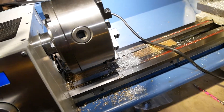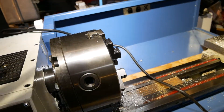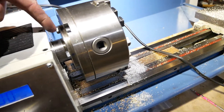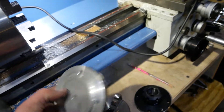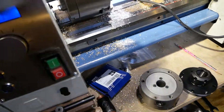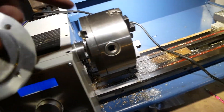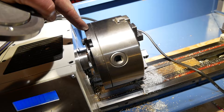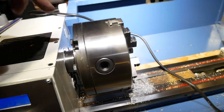While I was at it, since I was mounting everything to the lathe — once I had this piece cut to fit — I needed to use my little adapter. I needed to be able to duplicate this bolt pattern over to here, so I made this. It has that same shoulder on it. I flipped that over, it fits in there, and it fits into the shoulder feature on here too. So I used this to duplicate this bolt pattern onto this adapter plate so those two could bolt together, and once those two were bolted together I could bolt this to that.